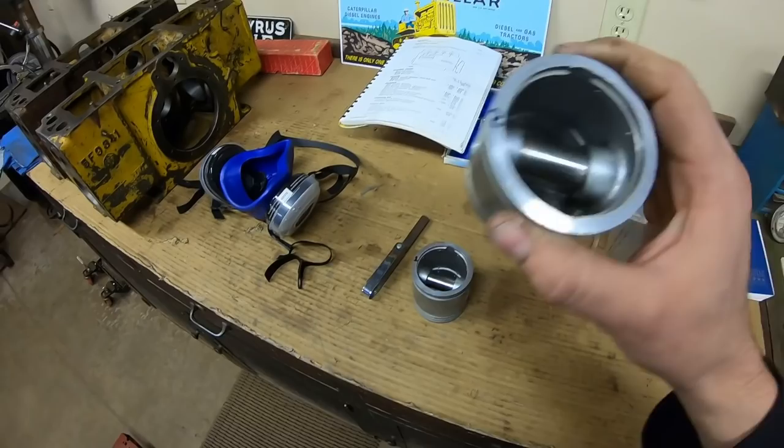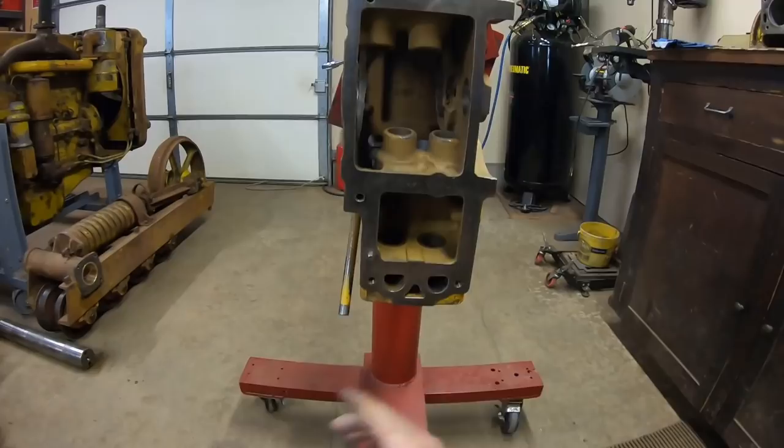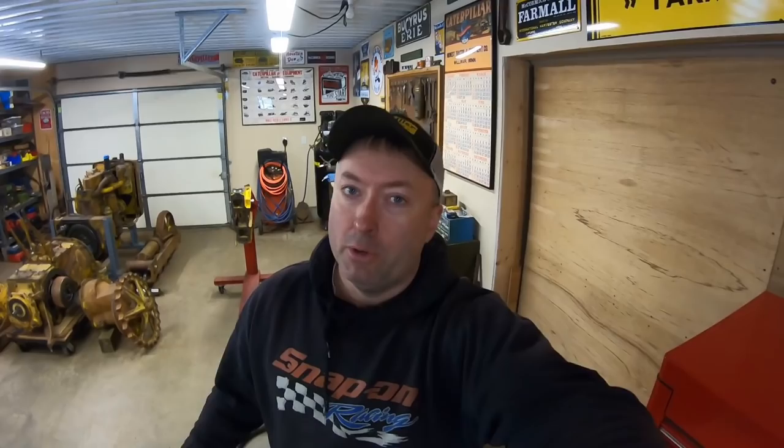This is a habit my brain got into with Ford Motor Company - this is just how I always reference these things. You can see these cylinders are offset from one another. This would be the front of the engine, this would be the rear with the flywheel on it. The forward-most cylinder is always number one and you count back from there - number one, number two. Pretty easy to keep all that straight. So you guys know what the process is. We've got the most difficult block done because we had to take that one out the furthest. I just need to use those 220 grit stones on those other two sleeved blocks to establish the final crosshatch and get the clearance of the piston to the cylinder wall.